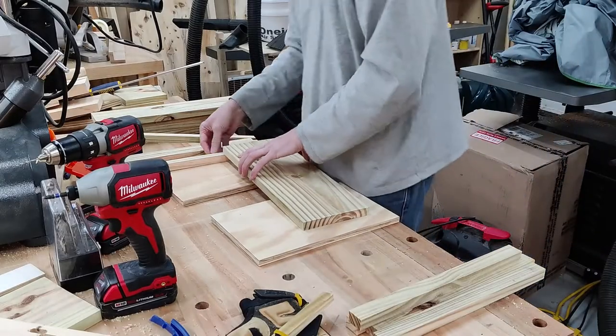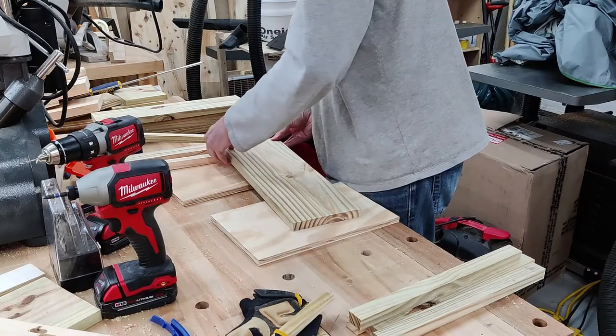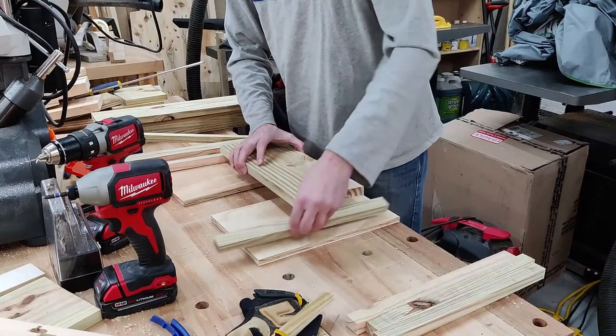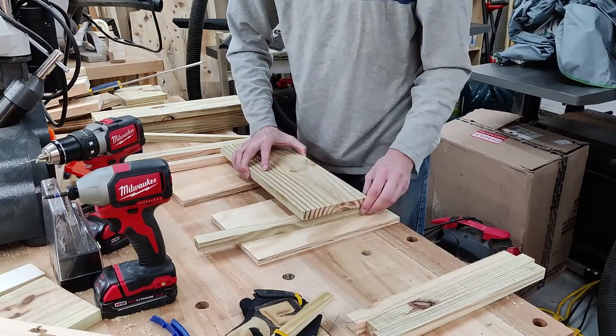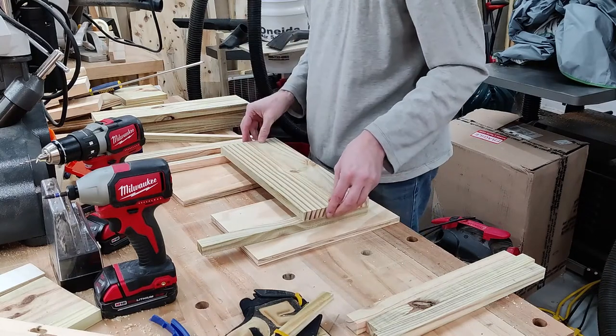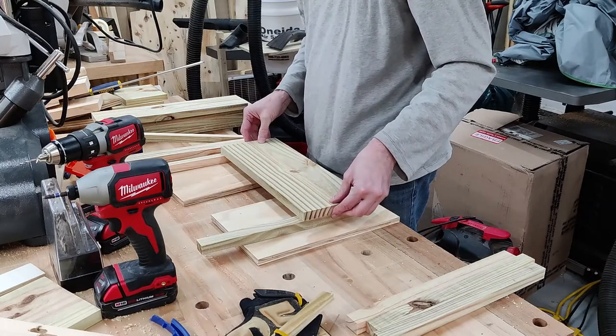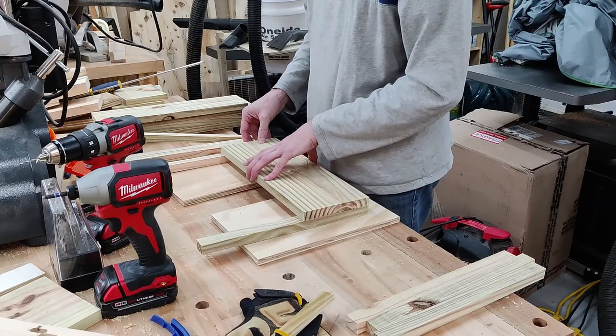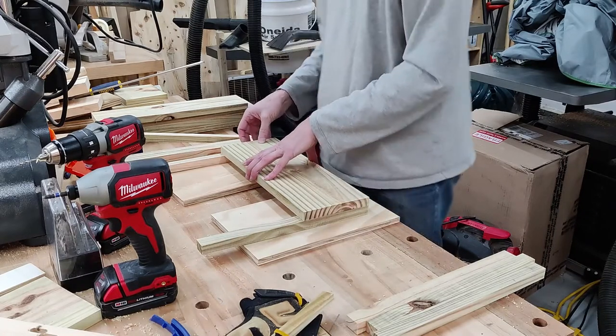And here we start to assemble the sides. So it's a couple cross pieces, a wide and narrow piece of 16 inch, followed up with a 26 inch piece. The cross pieces are just short enough for the width of the other cross piece on an adjoining side and the 1x6. So they're just basically butt joints on the corners. But that's okay, this is just a construction project, so it's not for pretty.